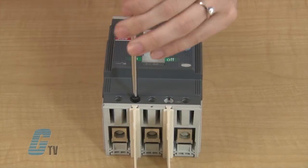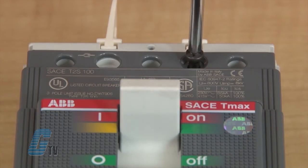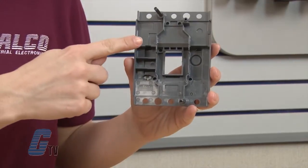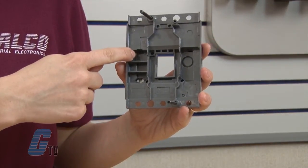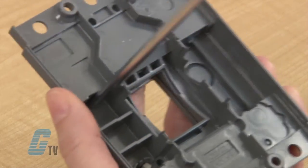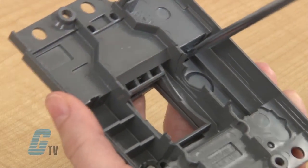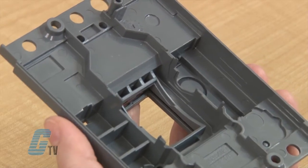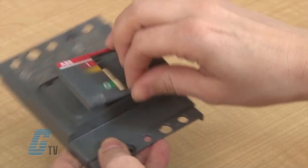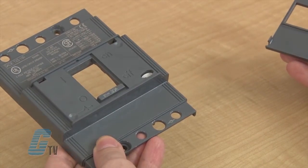Once they are in the test position, I can remove the captive screws and take off the front plate. On the front cover that I have just removed, there are two small tabs on the inside cover. With a small slotted screwdriver, I can push in the tabs while gently pulling the face plate on the other side. The face plate will come off and I can set this aside for recycling.